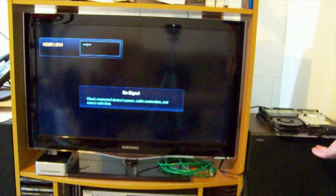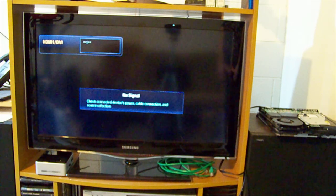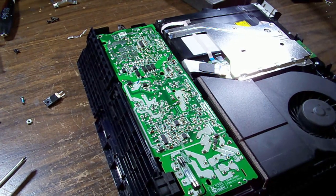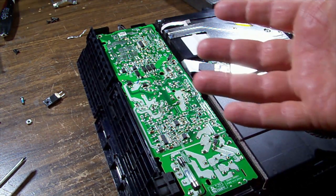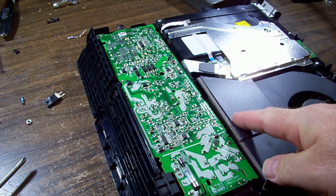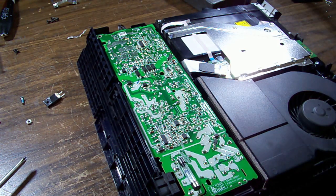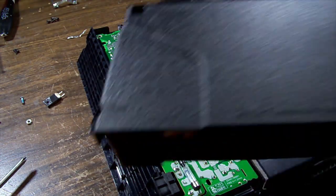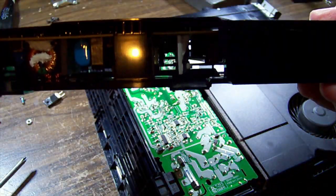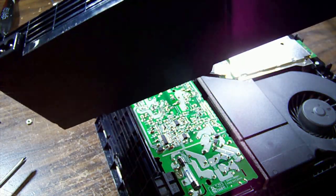Turn it on. Oh, well, it came on and went off. My guess is that it's probably monitoring the performance of the power factor correction, and as that's not functioning, it's shutting off. So I had a look out in the junk room, and I have another whole complete unit. I do believe this does not function, but with any luck, that MOSFET is okay.